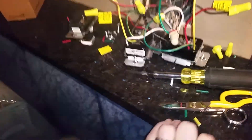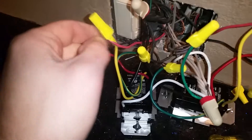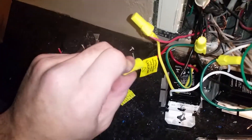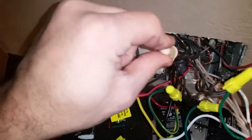So with that being said, your white wire goes to neutral, your yellow wire goes to the traveler, your red wire goes to your load, and then your black is common right here. Here's your black common.